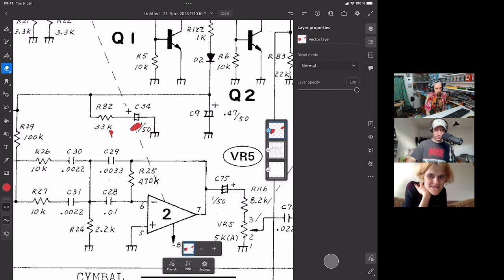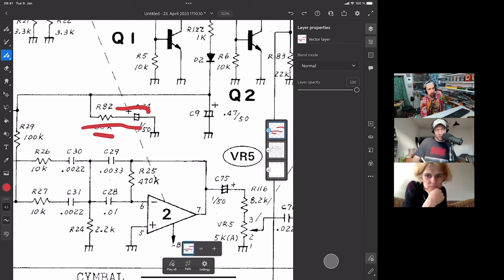That's the theory. But it's a bit messy because there's also an interaction: if the resistor is bigger, then less charge will actually flow into the capacitor in the beginning, and so the charge inside the cap will be less than it is if the resistor is smaller. And what happens if you swap them? Noob question, but if you swap them, I think it doesn't make a difference because it's in series. Either it's harder to push current into it or it's harder to push current out of it on the other side. But in effect, it's going to be the same, I think. But the thing is also, since we have the push button, we can just push it for longer, and so make sure that it charges up, and so it's gonna work.